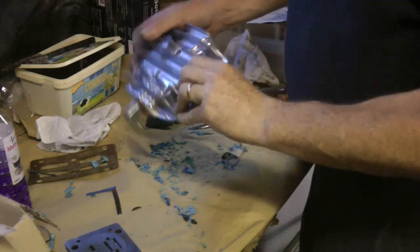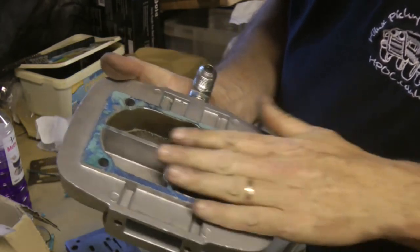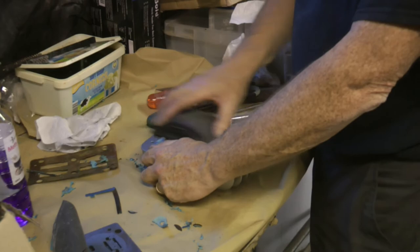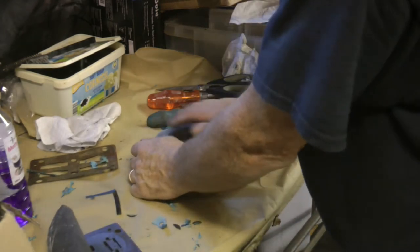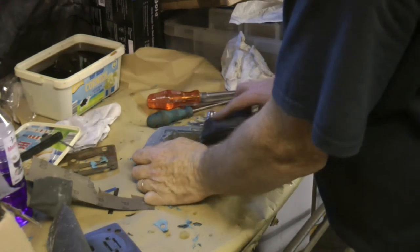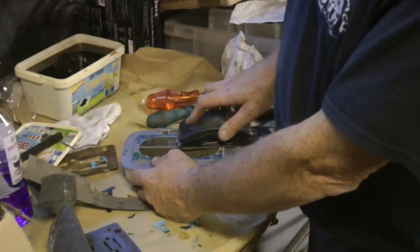I'm sweating trying to get this gasket off. I think that's probably as good as it's going to get with the scraper because I'm worried about damaging the mating face. So next we're going to do a bit of wet and dry just to get those last vestiges off and get it nice and smooth. I'm going to start off with some 600 grit and see how we get on. I've got some 400 as well, though it might be a bit too gritty. Incidentally this is not water I'm using - it's Coca-Cola - because of its slight stripping properties.